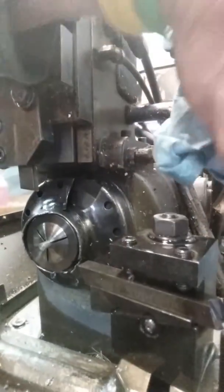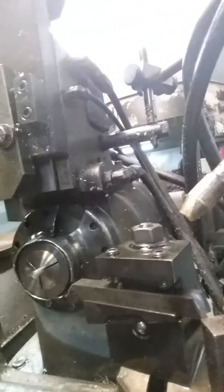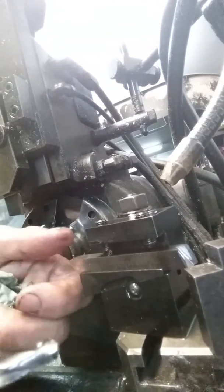Here's the tool height setter — this will set the height of my tool. My tool's upside down because I'm running the back side. This is the toolbar setter — it's got — oh, I dropped it, nope. Call me butter fingers, or hydraulic oil fingers. Here's your tool setter and that sets the height of the tool. We're going to put that right here and get our tool just so it slips over the top of that, and raise it up. We're going to get that tool just up a little bit so it fits right over the height of that tool setter. Old school, yeah baby.